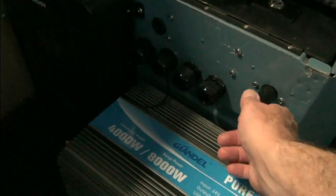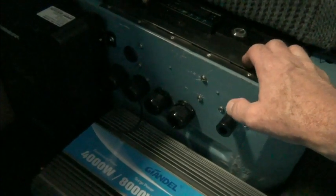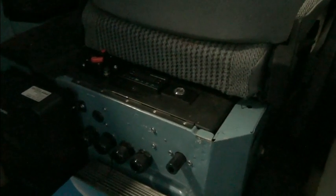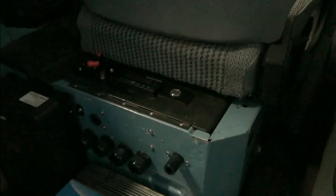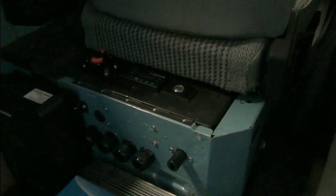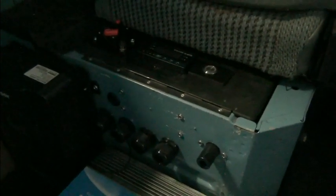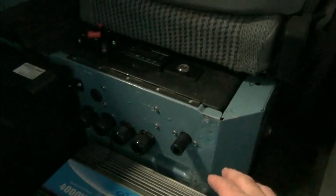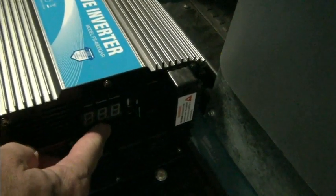And this allows us to turn on the charge controller first. You should always connect power from the batteries to the solar charge controller first. So we do that by turning this on. So we want to monitor all the energy in and out, so we would push that button, which you'll see in a later video when we have everything installed and working. That turns on our JLD 404, and it has memory, so that it won't lose what our current state of charge is. We turn that on. We turn on the solar battery pack, and that then will send power to both the inverter and the solar charge controller. The inverter has a separate switch, and so the inverter won't be on until we turn it on here, but it would have the 24 volts going to it.